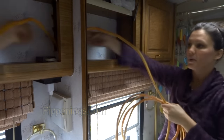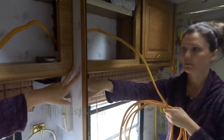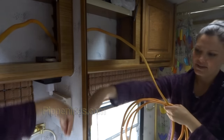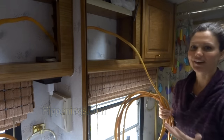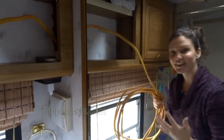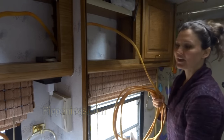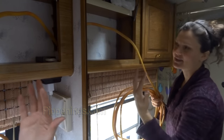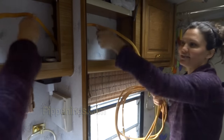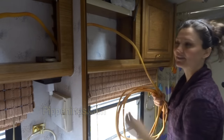I remember when we were feeding the new cables for the 50 amp system on the other side, in the distribution panel, down the same raceway, there are so many wires down there now that it was really hard. So I'm hoping I can find a good path. And if I can get this threaded through, when I get my new cables to bring up to the ceiling, I'll tape those cables to the end of this and yank this out and hopefully bring those cables up.